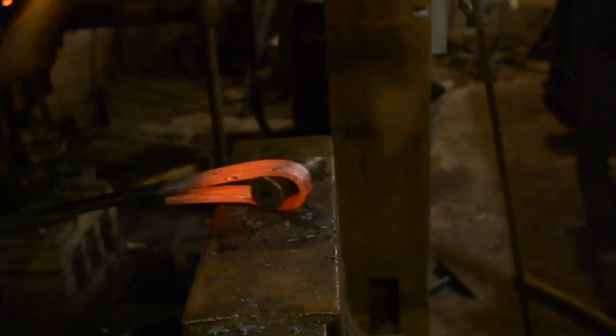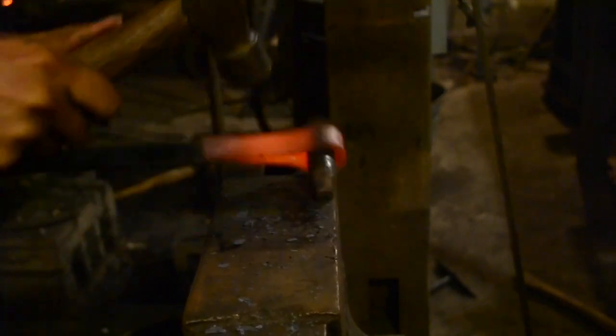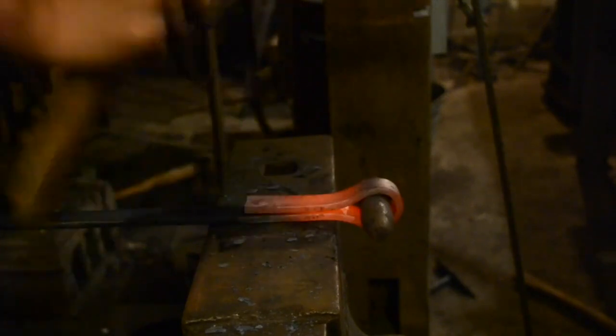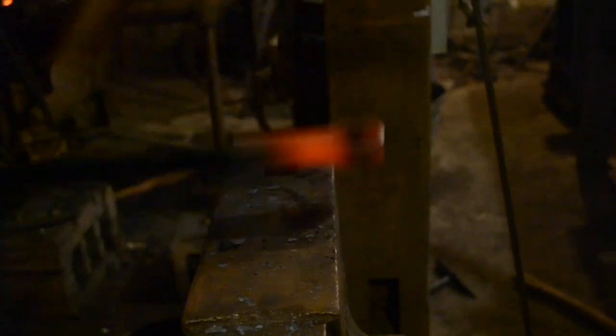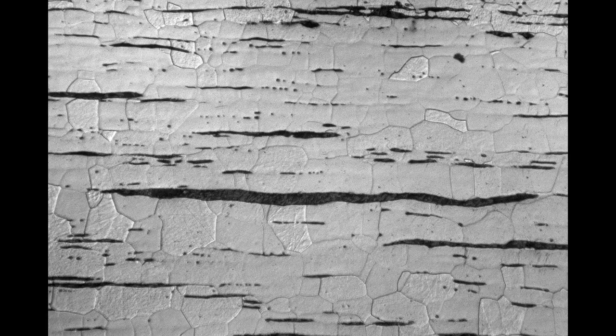One area that's sometimes mentioned is the uneven distribution of carbon and other minerals inside of historical steel, meaning that there are going to be soft spots and hard spots. But this is a relatively minor difference — on average, it should be pretty similar to the modern analog. The more significant difference is in the grain of the steel. These three images are micrographs of historical steel and modern steel. The black lines in the historical steel are slag inclusions — tiny veins of silica running the length of the steel. This changes the grain at a fundamental level. In modern steel, the grain is relatively fine and uniform, like a block of sandstone.